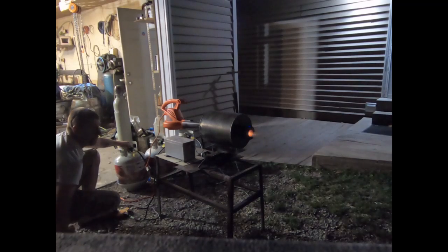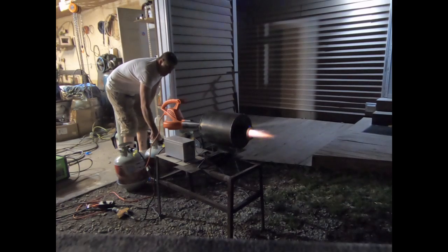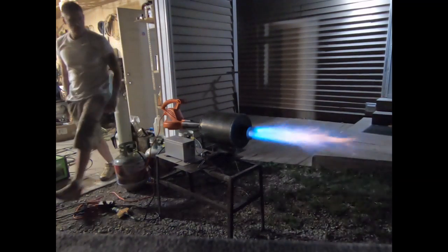A propane spud may be on the order of one or two millimeters, but for natural gas — that's a lower pressure system. Propane pressure can be at 120 psi in some cases, or 30 psi which is what most regulators run at. So we need a spud that's like 10 times bigger than what you would ever use on a propane system.